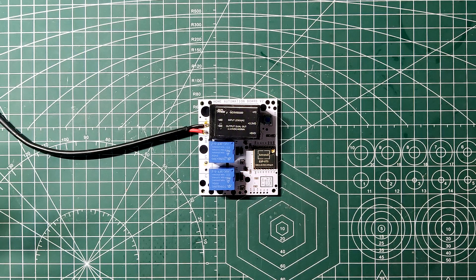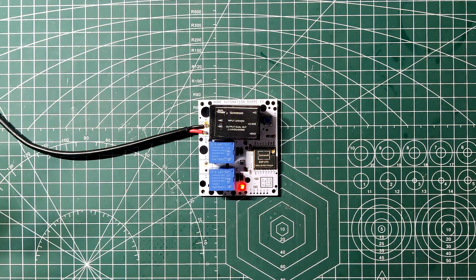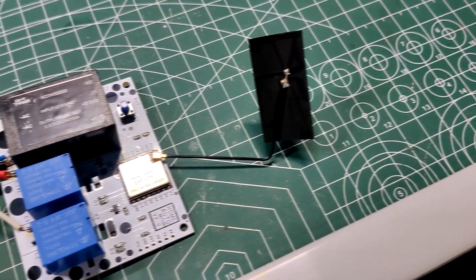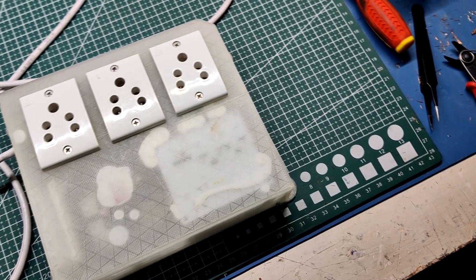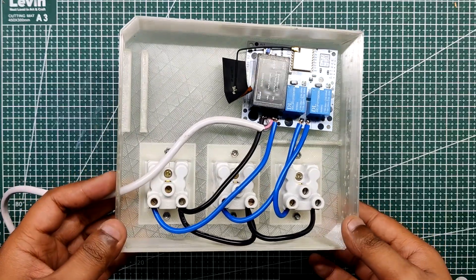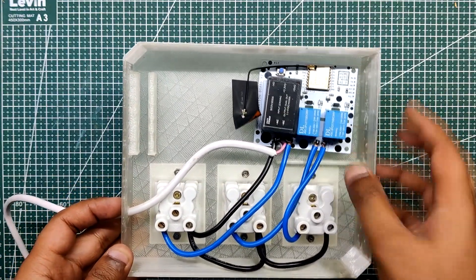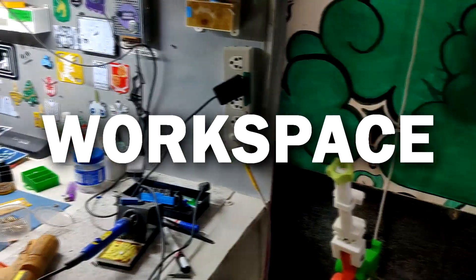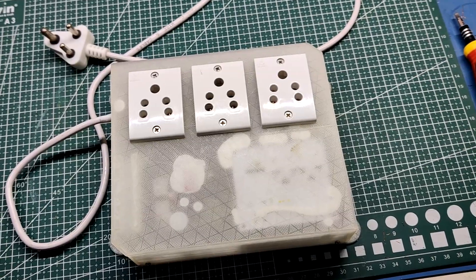This project's brain and brawn are a custom board made of an ESP8266 controlling two relays to switch different loads. The optimal situation was to design an extension board with AC sockets connected through a home automation board's relay, so that by toggling each relay we can control the state of each load. I needed a smart switch for controlling two loads in my workspace, so I made this project.